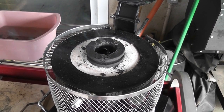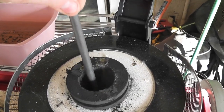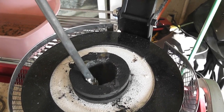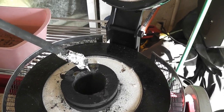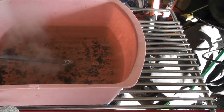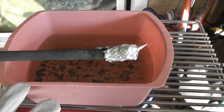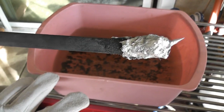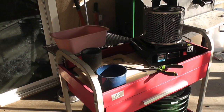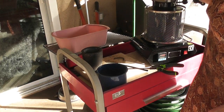I'm gonna go get the next one ready to put in. As the aluminum starts to heat up, I take my graphite rod and reach down in there and give it a good stir. A skin forms on top, and when I pull the rod out you can see that skin of molten aluminum attached to the graphite rod. I just quench it in some water so it can cool off. The furnace is busy melting aluminum — now it's time for the pour.